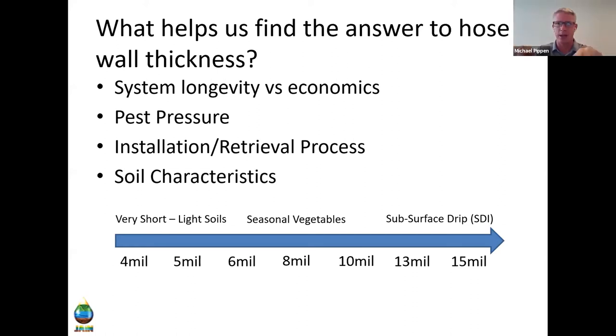And in general, with higher flow rate drippers, the bulb of that onion will be a little bit larger. The difference there would be, you might have a plant structure that doesn't have roots that deep, right? So there could be some things where that didn't make a difference out in the field. While your wetted profile would be different, it wouldn't really affect your field. So I think the answer to that question would be yes.